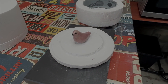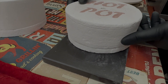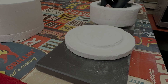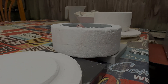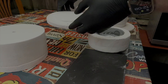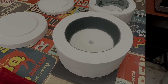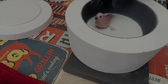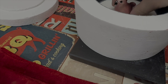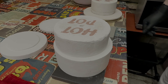The simple way to use it for small items is to place your item at the bottom piece of the kiln and then put the top over it. But for bigger pieces, the lid might stick out. So what I do is turn the big kiln upside down — because there's no graphite on the roof of the kiln — and place your item there, then get another kiln top and put it over.